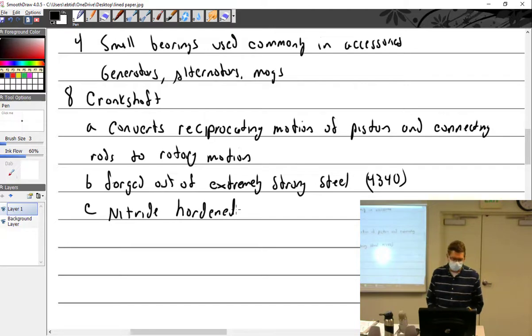Lycoming was a little different — back in my day you could go standard and polish to three, then when you went to six you had to re-nitride, and at ten you had to re-nitride. They've changed that now, and the newer service bulletins say re-nitride at three, six, and ten. What nitriding does is the ammonia gas permeates into the metal about five to ten thousandths of an inch deep, giving you very hard metal for wear resistance without affecting the base metal — so you still have a little flexibility.